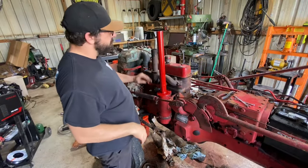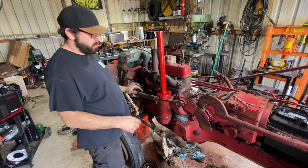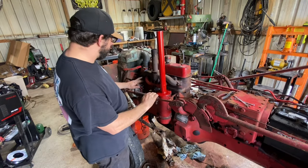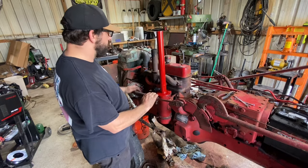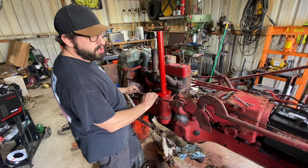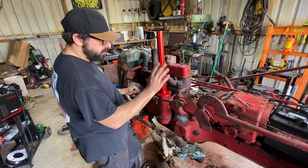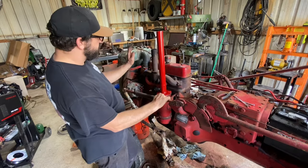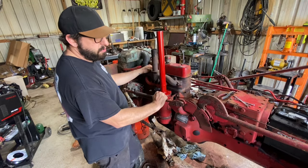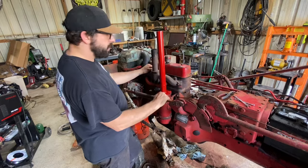All right, so we got our carburetor and our breather tube, breather back installed. We're gonna hook up the temporary fuel system again, crank this thing up, see if our alternator's charging. Then we'll go ahead and fill this thing up with water, make sure we ain't got radiator leaks. Then we will start changing fluids. We'll change the transmission oil. We're going to change the engine oil, filter, gear oil, and the transmission, top off the final drives, we'll top off the hydraulic fluid, and go from there.